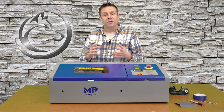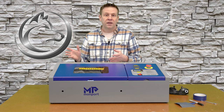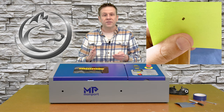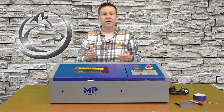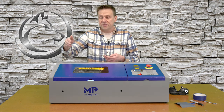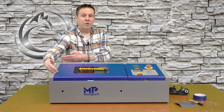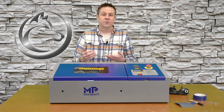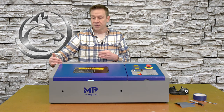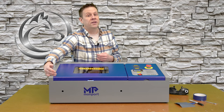The general principle is: I start at mirror number one and do a test pulse. I check that mirror to make sure I don't have a double beam or crescent beam, which would indicate an issue with the laser tube itself. Once verified, I move on to mirror number two. To get the alignment on that mirror, the adjustments are made on mirror number one — using the near and far test pulse positions, just like the initial check.